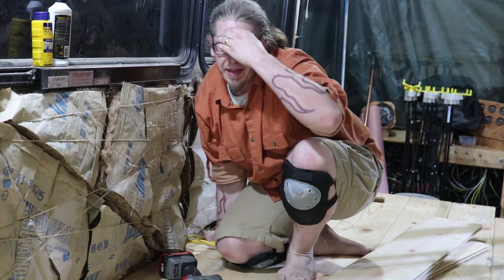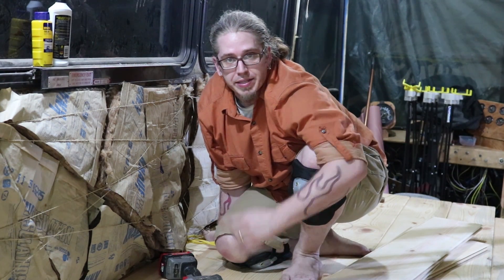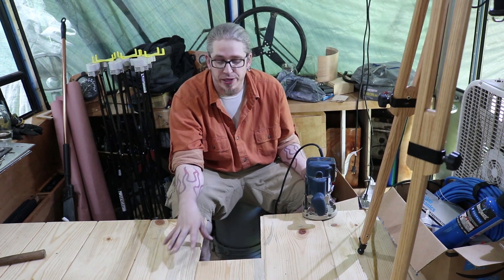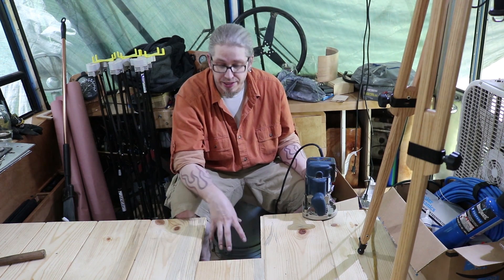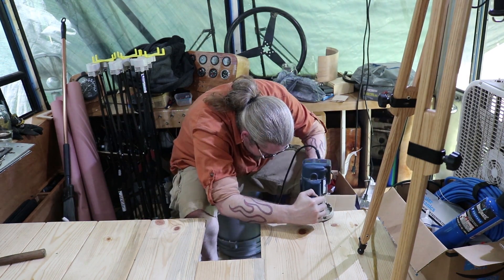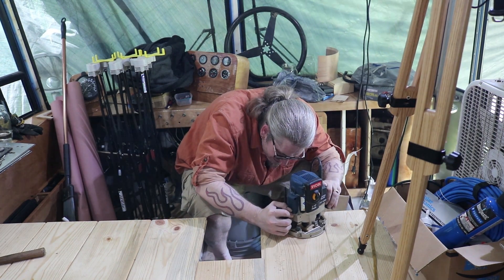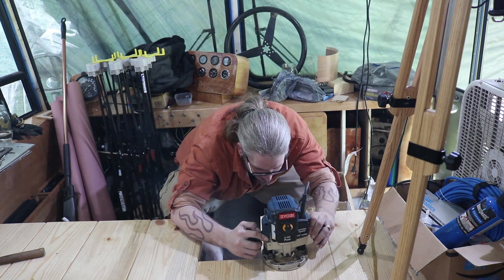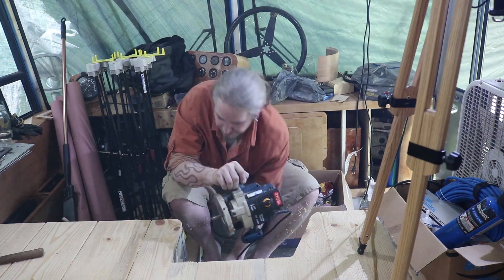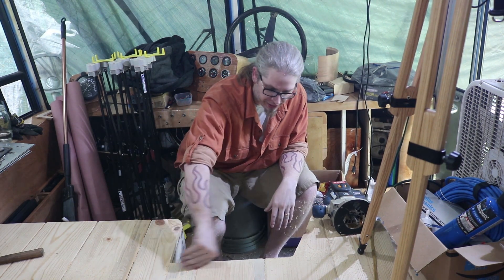The final piece is attached. Now we just have to go back and do some routing around the vents as well as the front to trim it off. All the flooring is done, but we have to allow for access points and cut the pattern out for the stairs. To do that I'm using a router with a three-quarter-inch bit and a guide. And just like that, we've made a fine mess that I now have to clean up — but a little sanding and we should have some rather nice entry points.